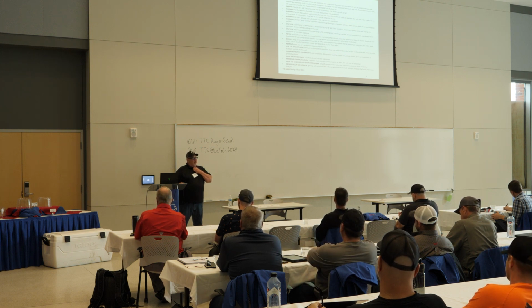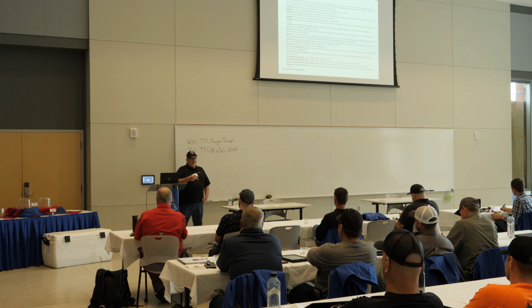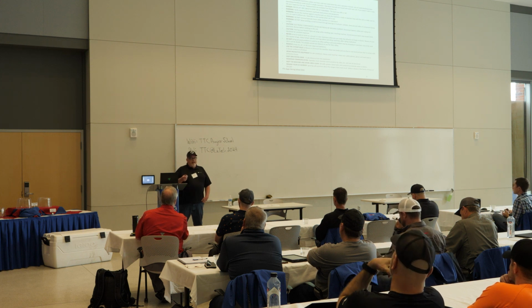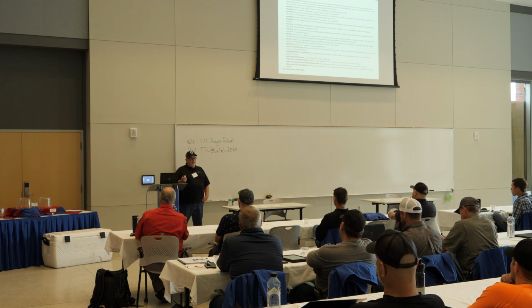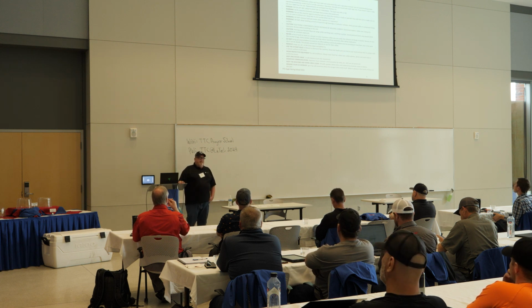the minimum size of the crew on an auger boring is 4 to 5 people. That's what I think is comfortable and safe. I've seen and heard horror stories of 2 guys out on an auger boring and nobody shows up. A guy's in the machine, he's doing a steering job. The other guy's up on the surface, so he has to take the steering pressure. So he gets off the machine and it's running, because you need the head to be turning to make a clearance for the steering job. And he stumbles through the spoil and falls into a master pusher that doesn't have a door and takes his arm off at the shoulder. And he comes back out, picks it up, throws it up on the bank, climbs up the ladder, and passes it up. So you've got to have the right crew, the right amount of people, everything to be safe. Just little things like that.